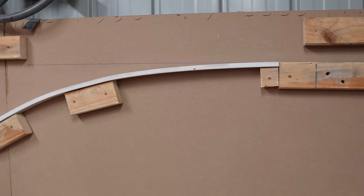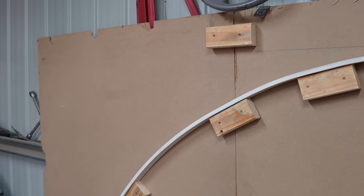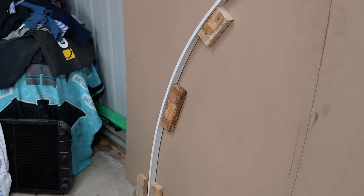Over here on the wall I've made a jig set up at a 90 degree angle, because these are my half hoops for the job. I've got 3.5 meters of span to get across, so each hoop needs to span 1.75 meters. I've marked out 1.75 meters from the wall and a height of 1.9 meters - I'm about 183cm so it'll give me just enough headroom. When the pipe heats up from the sand, I'll place it in the jig and it'll leave me with perfect hoops that remain nice and round without kinking.